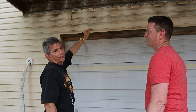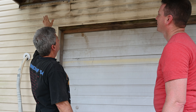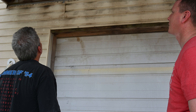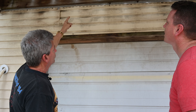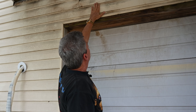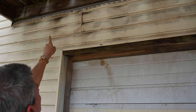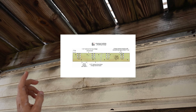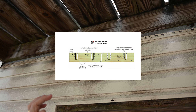This is probably the most important component of your whole deck — the ledger board — and this is where a lot of people get it wrong. This one is undersized, just like everything else on this deck. When you connect the ledger board you're allowed to go up to the metal flashing, but you can't go against it like this. At least they did that part sort of correct. But look at the fasteners — they did not use the required lag bolts with washers, which are required by code and there for a reason.